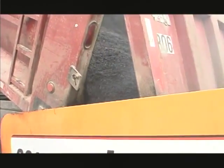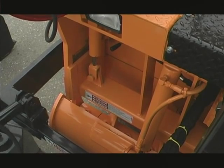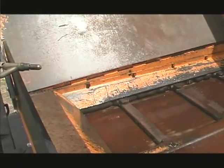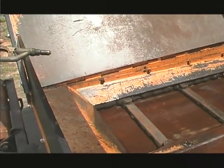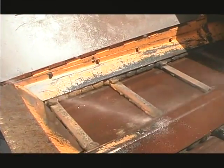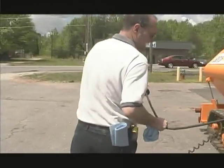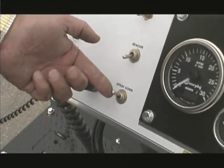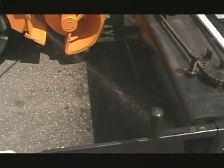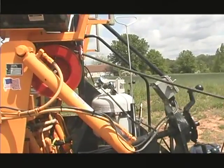When loading the machine, make sure the cutoffs are completely open and make sure the augers are raised to avoid damage to the cutoffs. The electric spray down is used to spray cleaning solvent on any part of the machine that comes in contact with asphalt. To use the spray down, unroll the hose and set the spray down switch to on. Then squeeze the handle and spray. After spraying, turn the switch off and rewind the hose and sprayer into the stowed position. When spraying with the solution, always be sensitive to the environment.